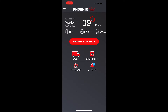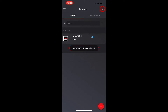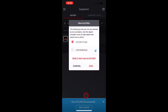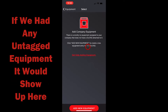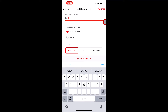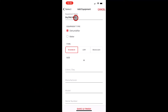Now I'm going to show you how to set up the DryTag RH in the DryLink app as a standalone thermal hygrometer. We'll click on the equipment tab, and if we don't get the blue banner after pulling out the battery tab, we can click on the refresh button until we get the blue banner at the bottom. We're going to click View Units — you can see the one that's in range and you can match the UUID to confirm it's the unit we want. We're going to click Add New Equipment, which is what you would do to set up a standalone thermal hygrometer. We'll type in 'DryTag RH1' — you can name yours whatever you like. I suggest writing it somewhere on the unit so you can identify it easily.